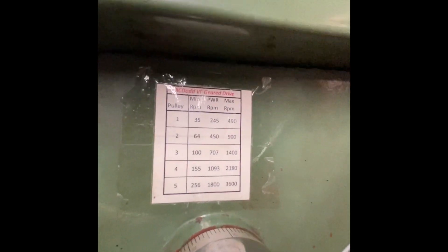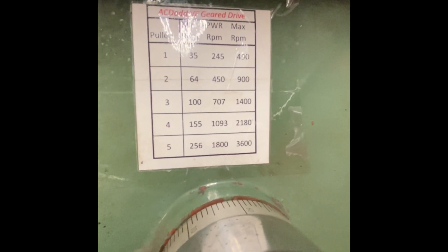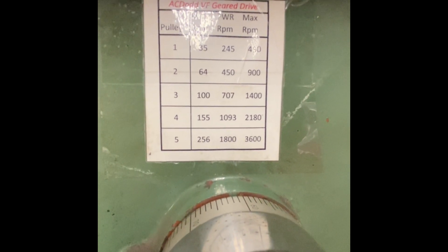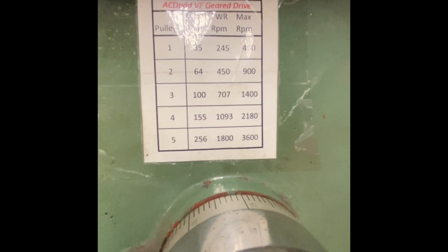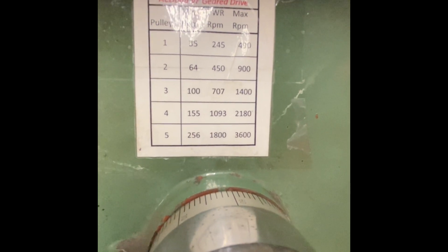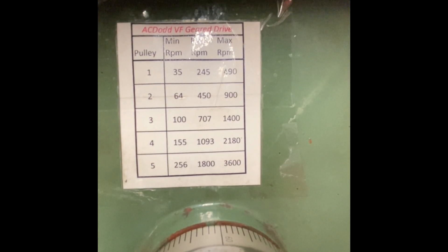The new chart on the side gives you the typical range of speeds. The numbers on the left indicate the pulley ratio, because you still use the gears to change the range of speeds, and then you vary the motor speed to give you the quoted speeds. So you've got three ranges of speeds. On the left-hand speed chart, at the top it says 35, 245, and 490. 35 rpm is typically the lowest speed you can get, but there's not much torque available because the motor power drops off considerably at that speed. In the middle is what's known as the maximum power rpm — that's the rpm in the bottom range where the maximum motor power is available.